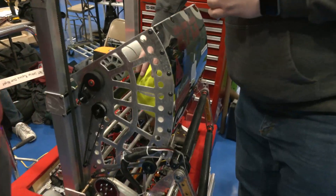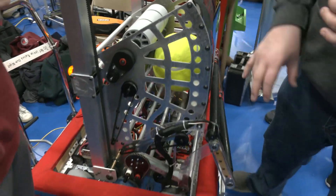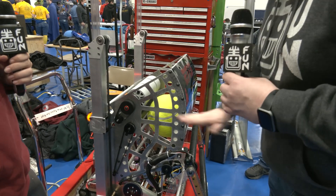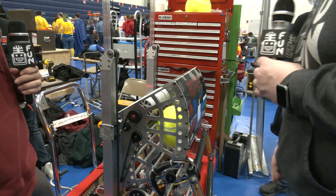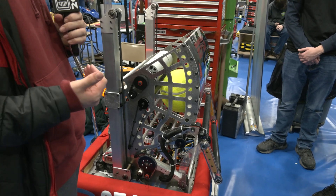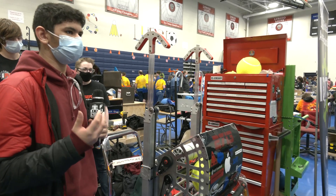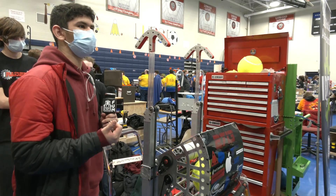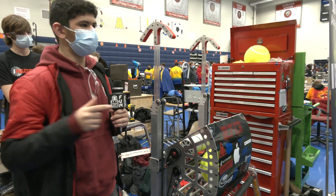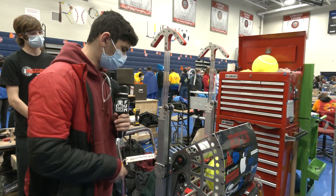When you were approaching this cargo piece — this ball is very different than the Infinite Recharge ball from a couple years ago — what was some of the thought process on spacing out your rollers and compression? And from an S-curve perspective, what is the big benefit versus a 90-degree turn? The big benefit of having an S-curve versus a 90-degree turn is mainly in auto, because a lot of the time it's easier to not have to turn as much, as well as during teleop. You're usually getting balls from outside of the hub, so it's easier to go out to the hub and back in to shoot without turning as much. We don't have to spend much time on that and we don't have to worry as much about burnout on the motors.